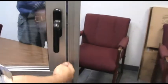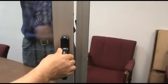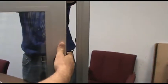If you have trouble with the sliding operation, you want to bring the sash up to the frame and view the reveal — the entire length of the jamb to the sash. If it is nice and even then you are adjusted correctly. If for some reason it is sitting at an angle or the opposite, you may have an adjustment issue in the rollers that can be corrected by doing the following.